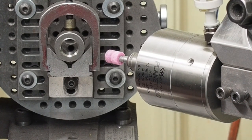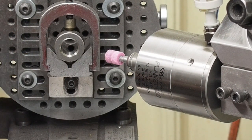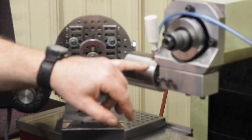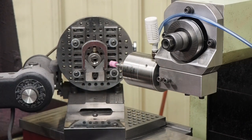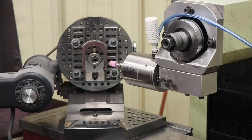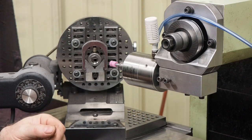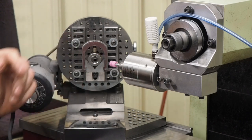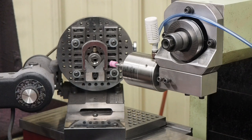There's also ARO — American Rotary Tool — out on the west coast in California, and if you're on that side of the country and you're interested, they carry these too. You can talk with Wolfgang over there and he'll be happy to set you up. These are nice tools — you can use this on a mill in a boring head as a jig grinder on your milling center, adapt it with a holder on your lathe as a tool post grinder. It's quite versatile across multiple machines, and that spindle is extremely accurate and runs smooth. If you think three grand is a lot of money, check out how much an ID grinder that would even come close to this accuracy and quality would cost — you'll find out this is really a nice option. That'll be it for this week — we'll talk to you next time.